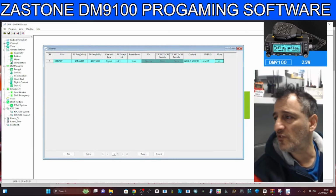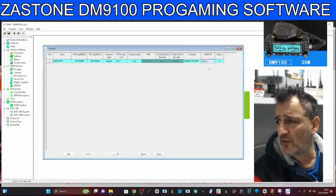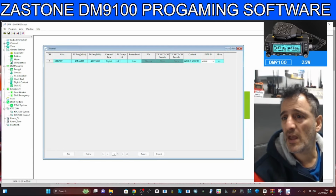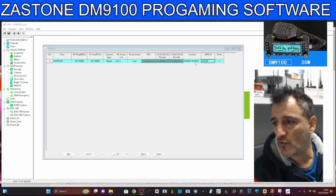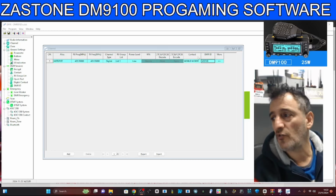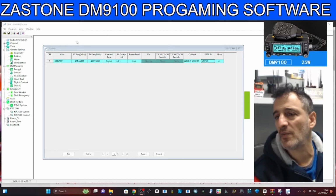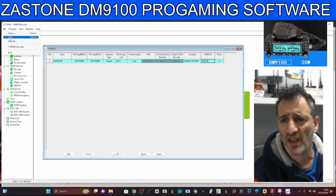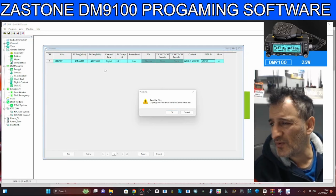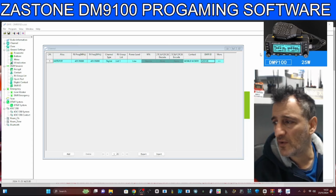If we go back to the channel now and click here, look, I can choose M0FXB. So when it transmits, it will make sure that it transmits using my DMR number on talk group 91 on this frequency on slot 2, color code 1. And you get it. I know it seems a lot to take in, but the only way you learn it is to keep doing it. So I'm just going to go File, Save, because I don't want to lose it. I'm going to click OK. And I would recommend you do that, especially when you're learning, because doing it all again would be really annoying.